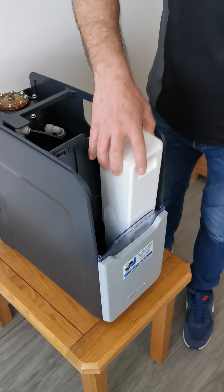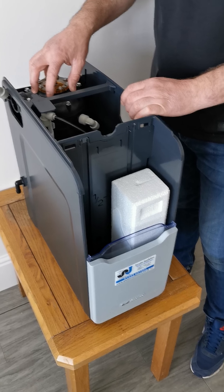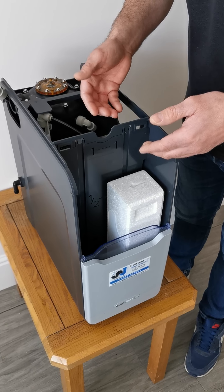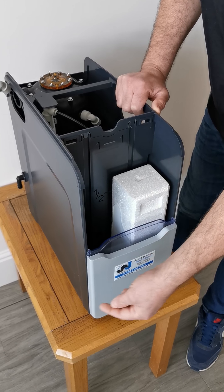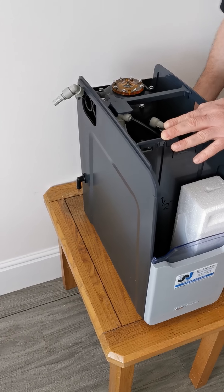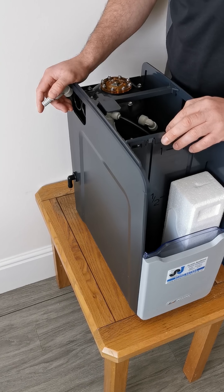If the water level was above the normal line, that would likely mean we've got a leak inside the cabinet somewhere, bringing in fresh water into the softener cabinet and dissolving the salt even quicker. Worst case scenario could be overflowing, but hopefully the overflow is installed correctly — that would be on one of the sides here, going to an outside wall.